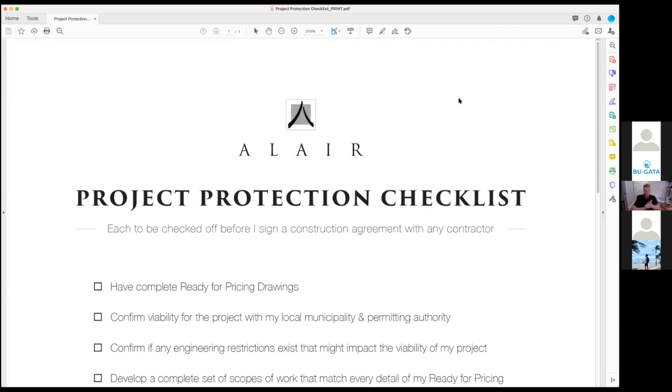They are balloon framed. What that means is that the first and second floor walls are framed continuously up to the top. One of the challenges with most of those style constructions is there wasn't really any engineers really thinking about footings at that time. So a lot of those houses, the block walls or whatever the foundation walls are, instead of sitting on a traditional spread footing, which is somewhat wider than the wall, they just sit there right in the dirt. Or you could run into a situation where there's stacked stone or something laying in the dirt that is supporting those foundations. So a lot of those houses from the teens and 20s and earlier than that, we have to do some upgrades and some checking out of the foundation.